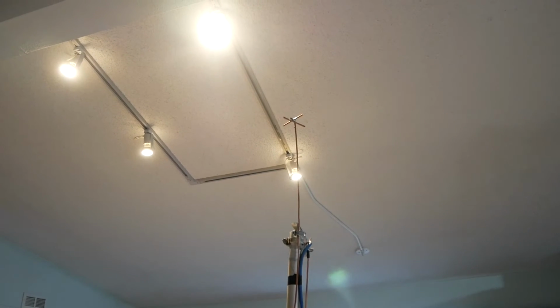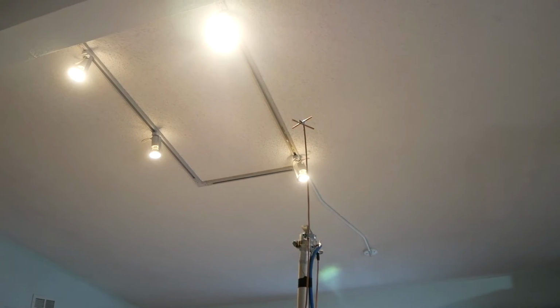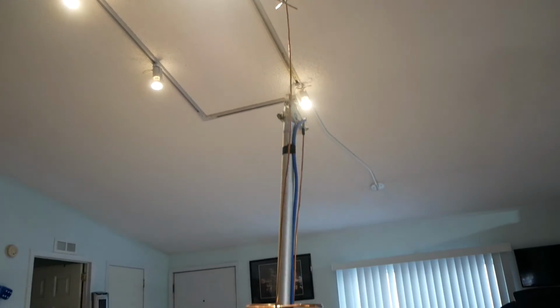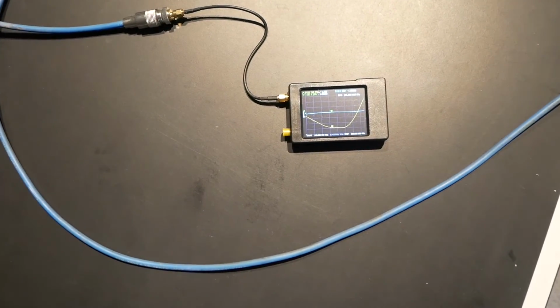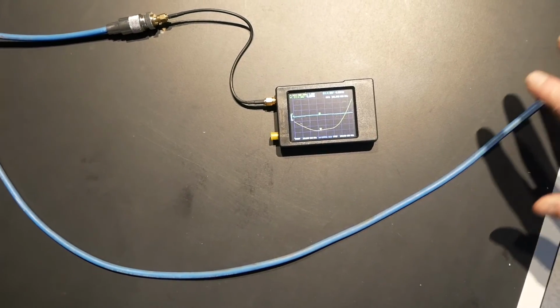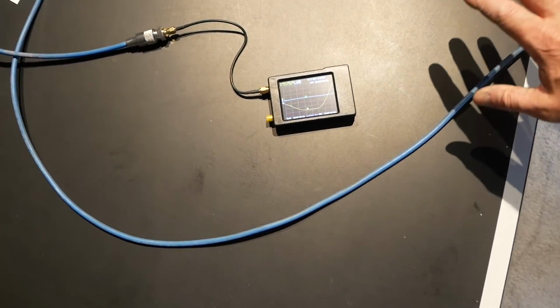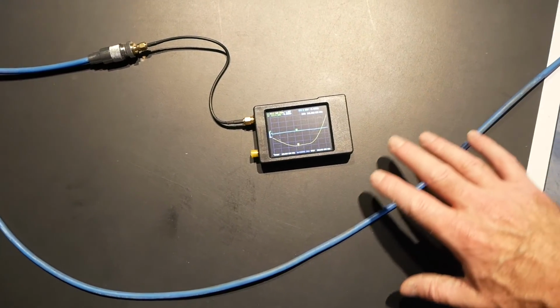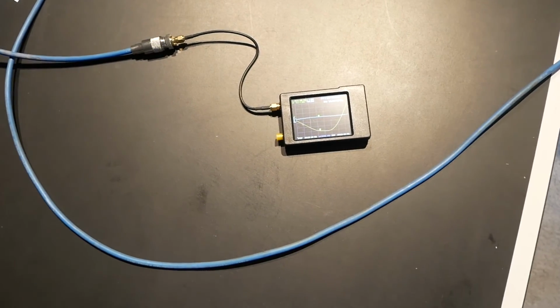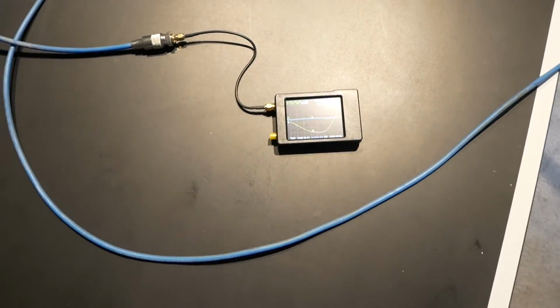So I've got that cap hat down to a 2.5 inch cross of copper, and the rest of it's like so. Now, one thing I've noticed on this antenna already, you'll notice as my hand gets close to the coax, it starts changing. So this thing is loaded with common mode current. And I'm going to see if I can fix that right now.